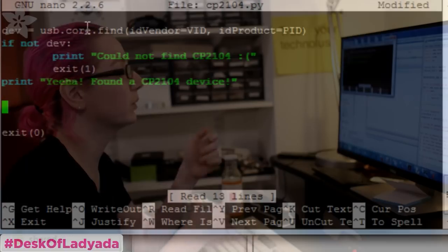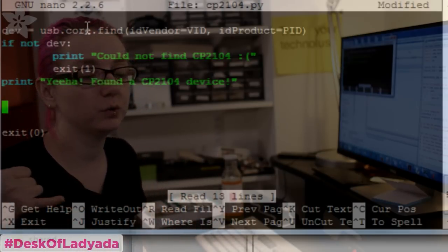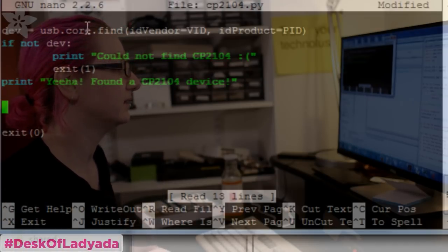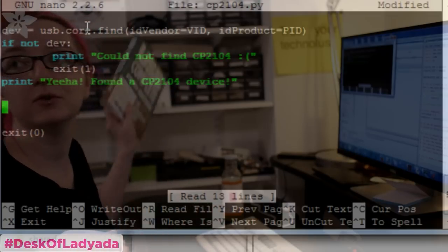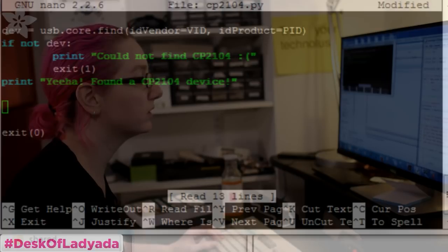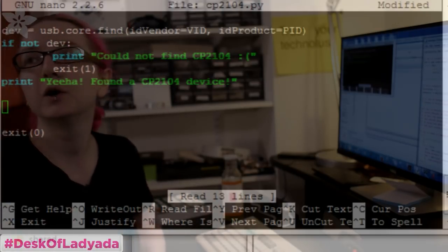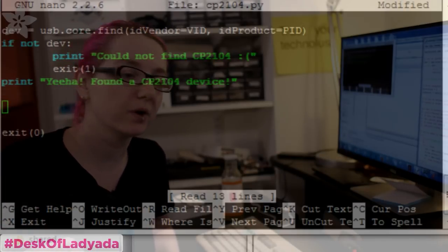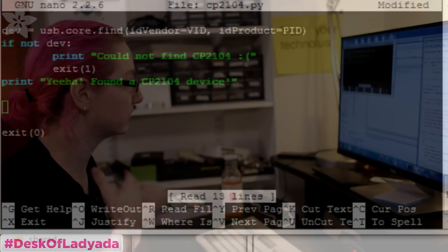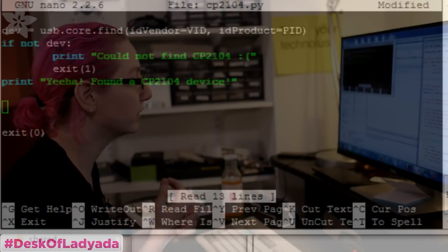Excellent. So here's actually where we get to do what we want. What we want to do is connect to the control endpoint. And again, Jan Axelson covers all this stuff about endpoints and interfaces, but we're just going to, actually, do we need to know that? No, we don't, sorry. You can send a control transfer without knowing the actual endpoint and interface. You just say, hey, I want to send a control transfer. So to send a control transfer,